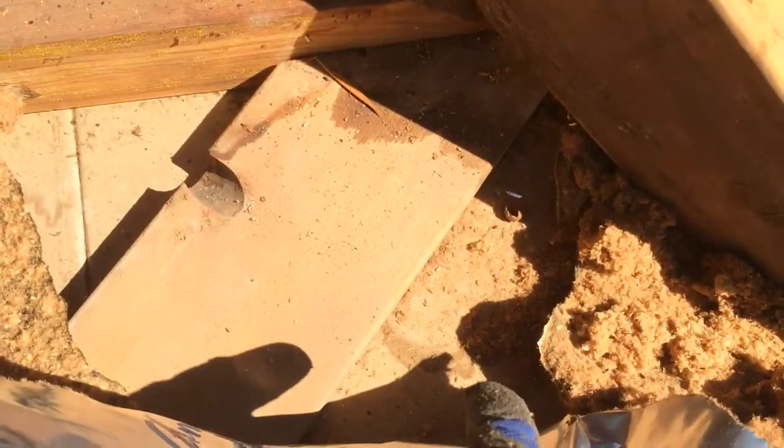Note this board coming across the ceiling here. The fact that this insulation was not in contact with that basically makes it not work. It's really important that insulation is touching what it's supposed to insulate.